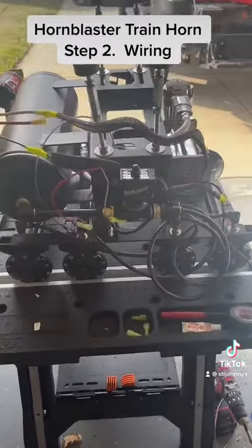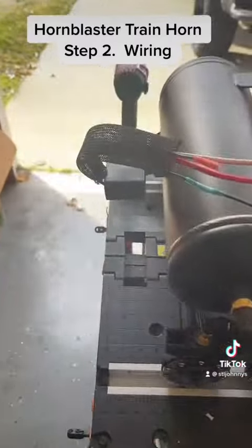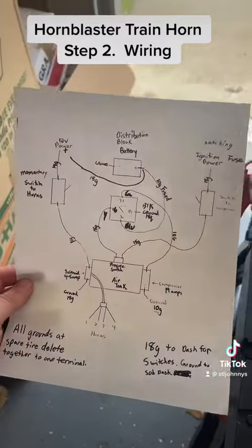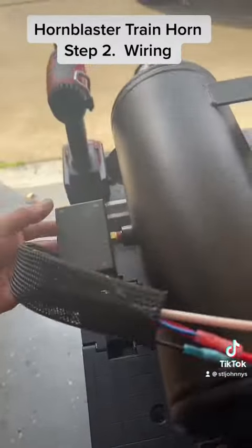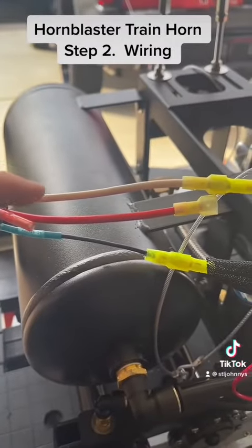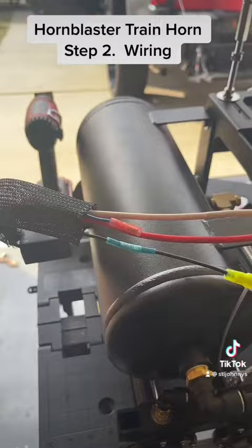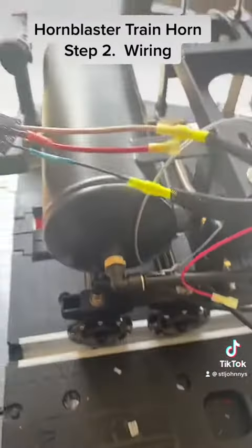Got an update here just for the wiring. I was going off of a diagram I saw online, but apparently that diagram is for just a single pressure switch with two wires coming out. If you get the pressure switch — the big one with the big red 10-gauge, the white, and the smaller blue and black — the relay is already inside this whole little box right here.